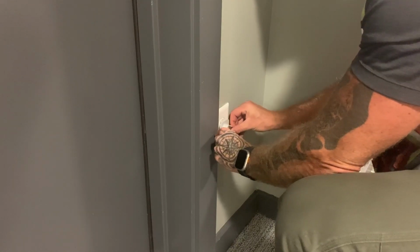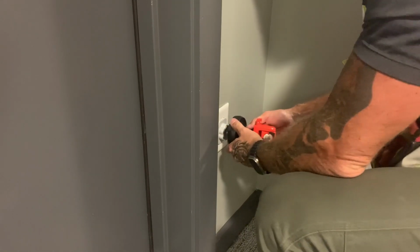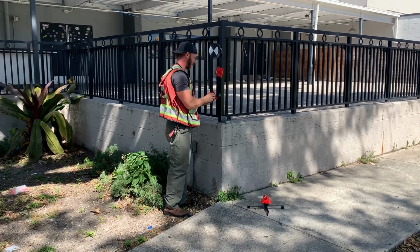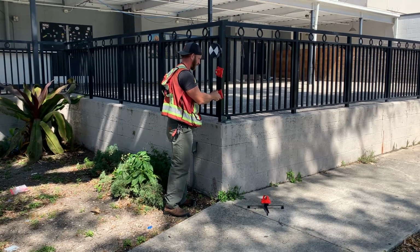The white paper already tested the swiveling action of the prisms and the quality of the glass, but I wanted to test how precise the electrical outlet mounting point is, how stable the floor mounting option is between swaps, how well the targets align to the prisms, and the centering error when taking a prism off a disc and putting it back on in a different orientation.